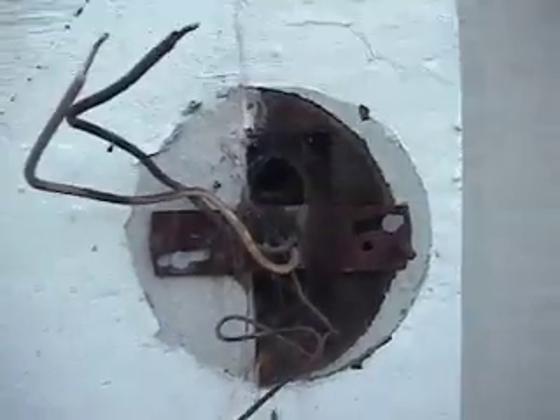I cut the fuse and took the old fixture off, but there's the ground wire — and nothing was connected to it. That light wasn't even grounded! And then check this out: we've got nails instead of screws holding the plate to the wall, which is all rusted anyway. So this is going to be a major improvement.